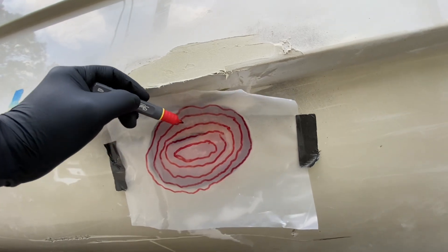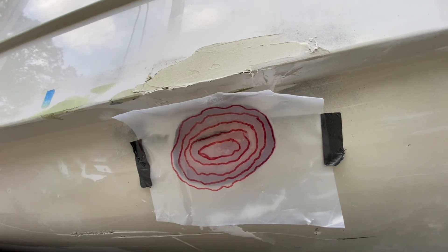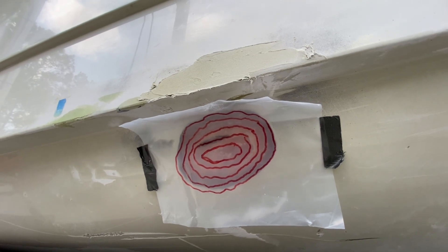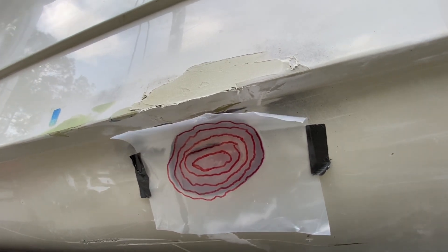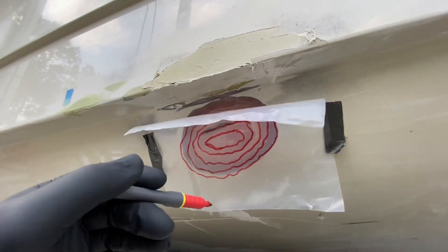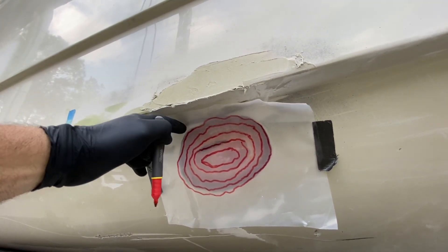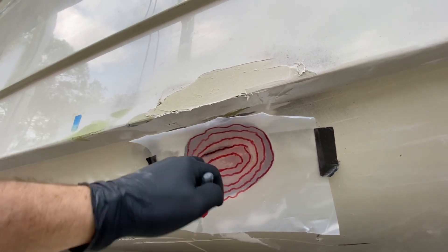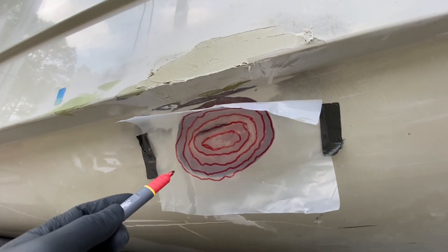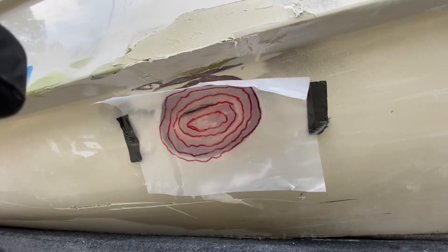You can go back and forth on biggest layer first versus smallest layer first — it's open to interpretation and different standards say different things. Gougeon Brothers West System Pro Set epoxy guys say big to small, Coast Guard says big to small, and ABS I believe is big to small as well. I'd rather go with the industry standard: largest layer of reinforcement first, then cap it off with chopped strand mat and repair it as built. This is all going to be quad-axial stitch mat from VectorPly — the same stuff that was used in the boat — so we'll go in and get our layers cut out.